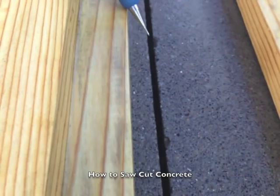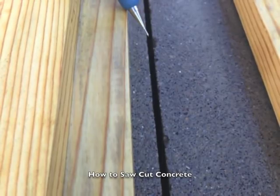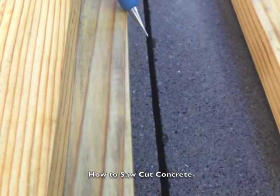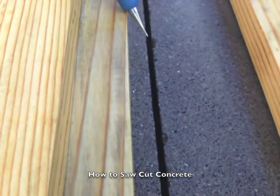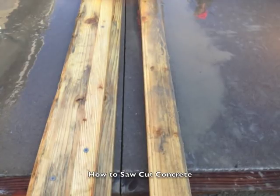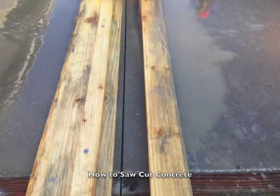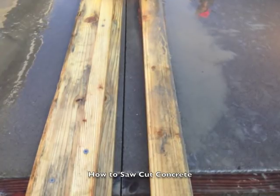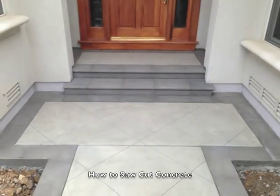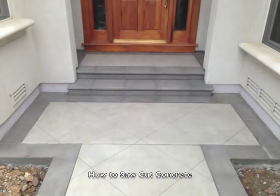The other concern is how the rock in the concrete mix can flick out and leave holes in the cuts, as you can see here. This is small enough in most cases that it's not an issue, but it is something to consider. These edges are also weaker than a hand trowel joint, so keep that in mind when deciding whether that's appropriate for your situation.